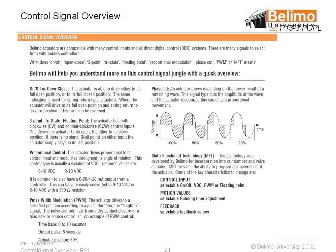Let's quickly go over control signals. Everyone knows we have all different types of control signals — these are the items that tell the motor what to do. We have on/off, open/closed, tri-state floating, and proportional which is a 2 to 10 or 0 to 10 signal with feedback. Then there are proprietary applications that different manufacturers came out with, which is pulse width modulation and phase cut. These are out there — are they that popular? No, but they are around and we do have abilities to talk to those.